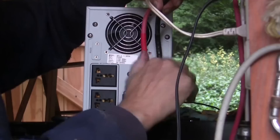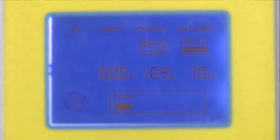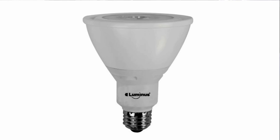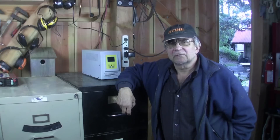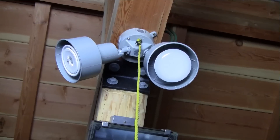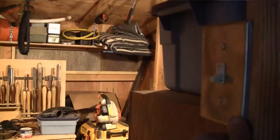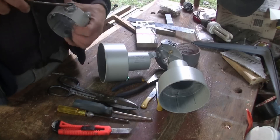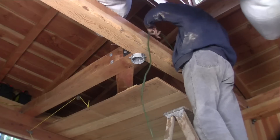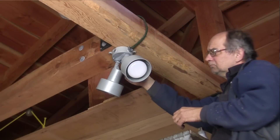So far so good — the charge controller seemed happy. I ran a six gauge pair of wires from the bus bar to the inverter and switched it on. The front panel displayed a happy face, which naturally I took to mean all is well. Each LED bulb only draws 12 watts and my plan was to install four fixtures with eight bulbs to light my work area and a further four bulbs to light a previously very dark storage room. The four shop fixtures are individually switched using a ceiling fan pull switch — the switches came cheap from eBay via Singapore. The storage room has a single wall switch controlling the two fixtures. This was all much more time-consuming than I expected, figuring out how and where to run wiring as discreetly as possible. I always wanted to retain a clean-looking building interior, but with each additional modification things are getting messier than I would like.